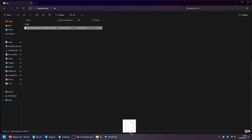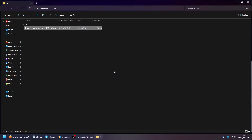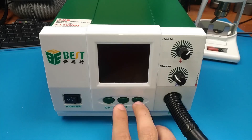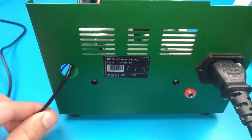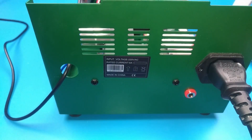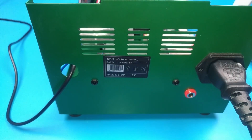The station will immediately reboot with the new firmware. For future updates you won't need to press the USB boot button. Instead, press and hold the CH2 and CH3 buttons while turning on the station. I suggest leaving a USB cable permanently connected to the board, using the convenient hole on the back of the station to feed the USB cable through.